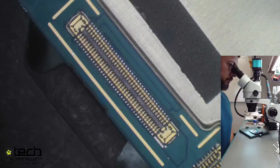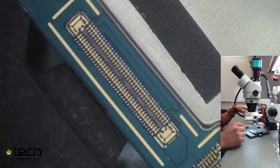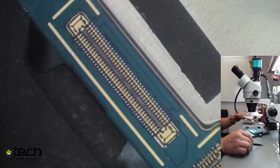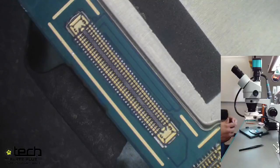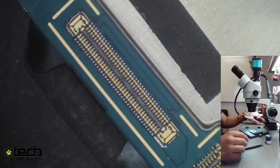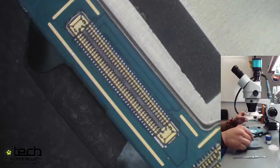If you're interested in learning FPC repair, this is one of the courses offered at the facility — along with solder charging port training and backlight repair. FPC repair is a great skill if you want to offer support to other shops in your area. Connectors are being built more securely in newer devices, but on S21s and A-series devices it's not always tech damage — sometimes manufacturers don't solder connectors well or use lower quality solder, so they don't hold as they should.